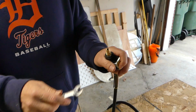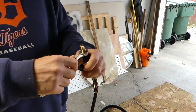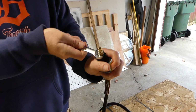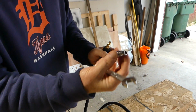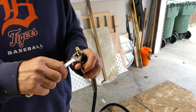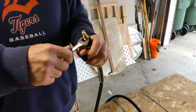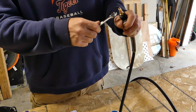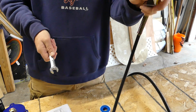And like I said, that is a 14mm, or whatever size that you have. You might get a different size, but the important thing is NPT 1/4 inch quick disconnect, and that's just going to thread right in there. I'm not sure exactly why that fitting comes on, but it is not going to work on your air compressor. So just a heads up, when you're out picking up your jack or ordering your jack from the link in the description from Amazon, pick up an NPT 1/4 inch quick disconnect fitting.